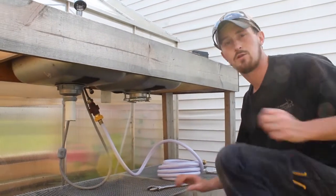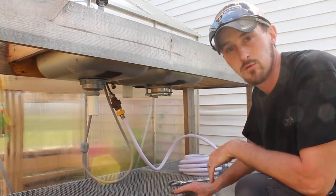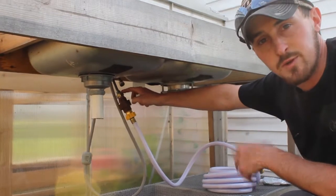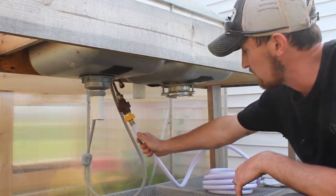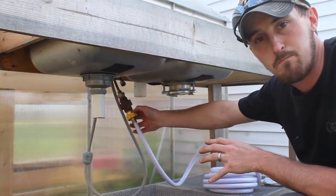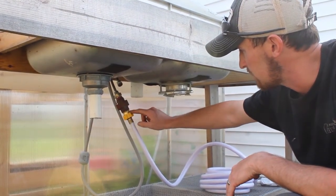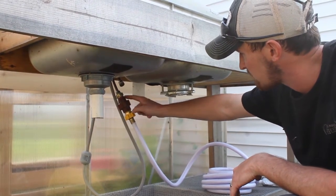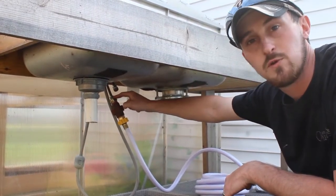Alright, so it didn't take too long. Worked out pretty well. Again, just a little bit of a repeat: I had some extra fittings in the toolbox and made it work. Got a regular garden hose, 25 foot, going to a special fitting made for a hose, going to a half-inch to half-inch union, a half-inch reducer, and then I got that hooked up to our sink.